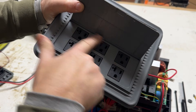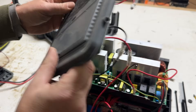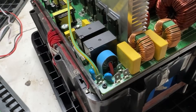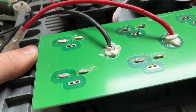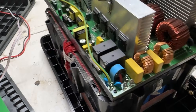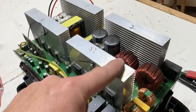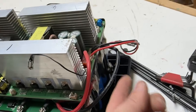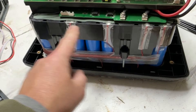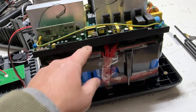This is actually really cool — this panel. I might build my own new one of these down the road and I think I can use this. It's a really nice little panel. Right here is our AC out to our outlets. This was plugged in right here. Interestingly, there was no ground — there's no actual ground on there, so even though there's a ground on the outlet, they weren't really grounded to anything. I wonder if there's still a way to use this as an inverter. This is most likely the inverter here — this whole section, with the largest heat sinks and the transformers — our 2000-watt inverter right here.